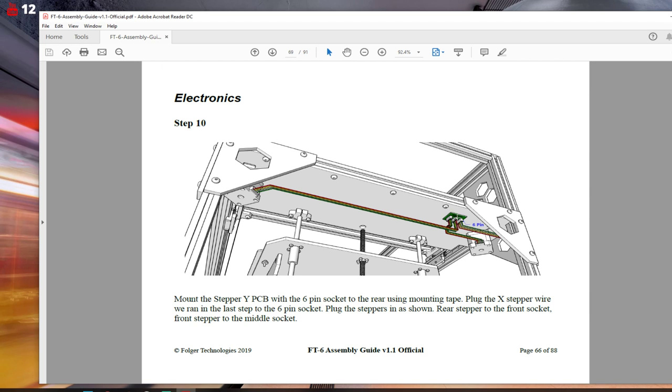The only thing about this part right here was that those connectors, the prongs stick through the back of the PCB, which is normal, but their attachment for this was to place it, stick it up there, and then hold it in there with the VHB, which is very high bond 3M tape. Because that's not a perfectly flat surface, because those pins stick out the back of the PCB, your mileage may vary on that.